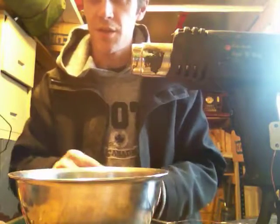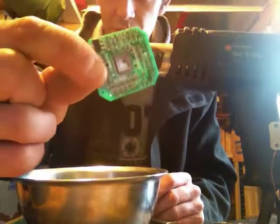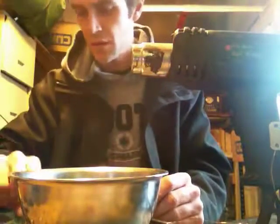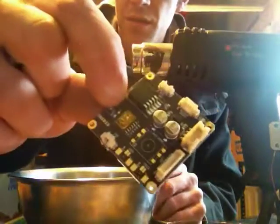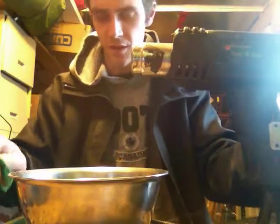Alright, today I'm going to show you a quick and easy way to remove all your little chips from the boards. Here we got a little camera, some brown chips. Also have a few other boards where we remove all these chips too. Nice and easy. The easiest way to do it is with a heat gun.